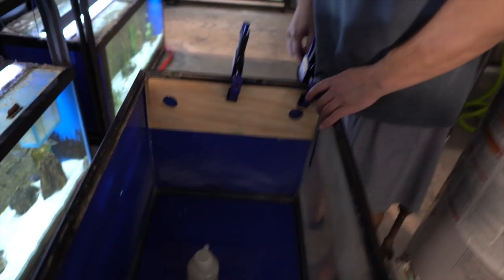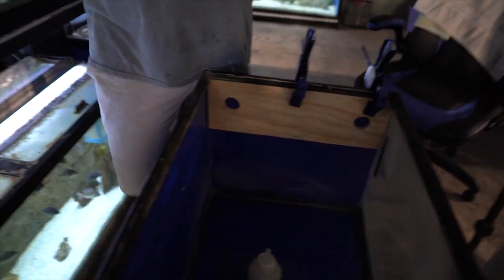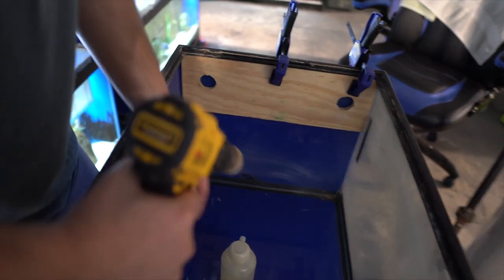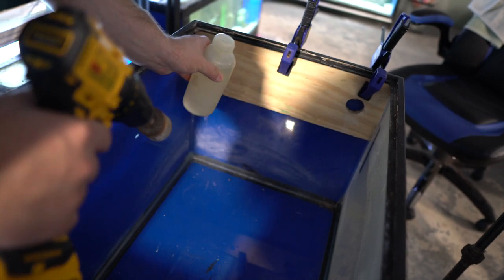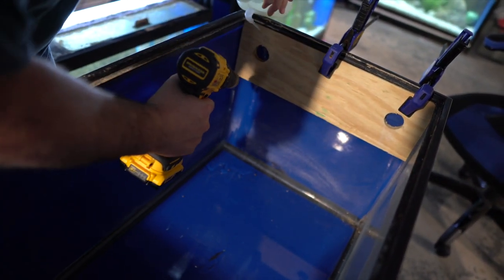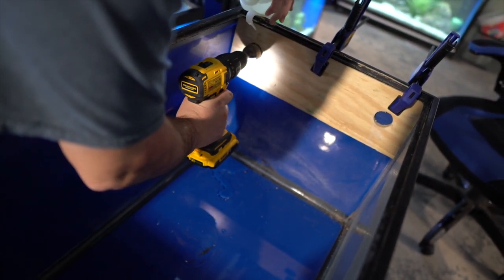All right, so we'll drill this 40. We gotta get our water. Biggest thing is you don't want the bit to get hot, so we're using our bit here. And then we're going to drill this here, so we're going to keep some water in the hole that we want to drill. Biggest thing is to keep it wet, so we're going to start drilling and see what happens.